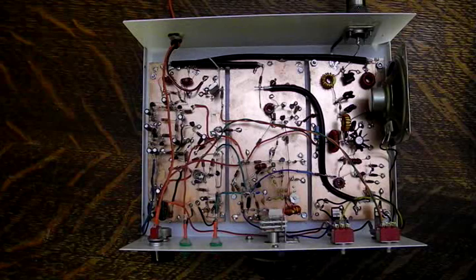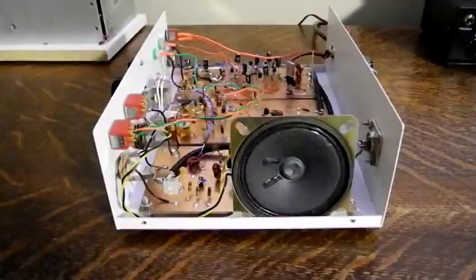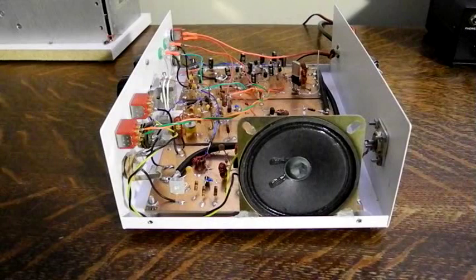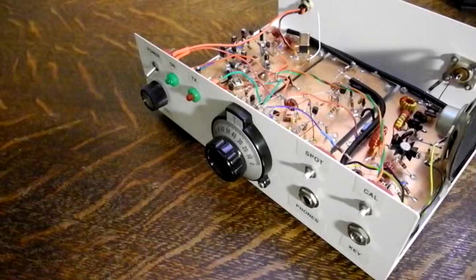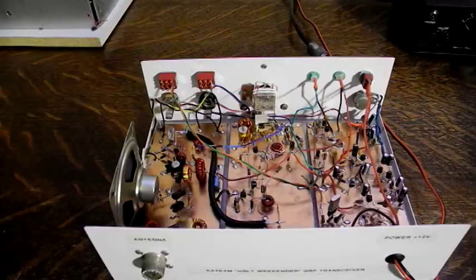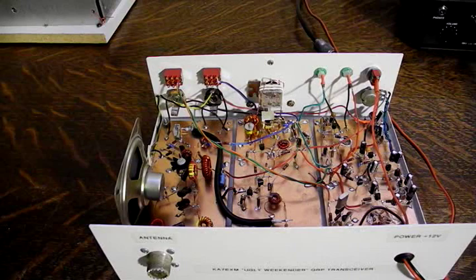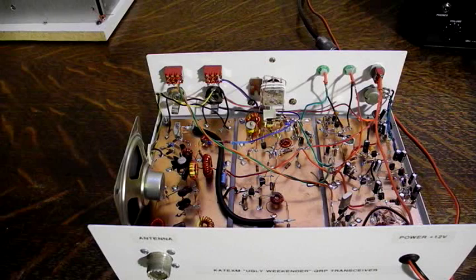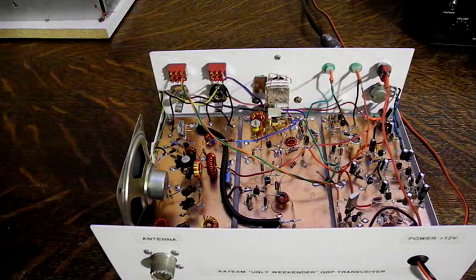Here's a look inside. From left to right we have the receiver board with crystal calibrator and sidetone oscillator, then the VFO and control board, and finally the driver and power amplifier. I followed the design with no significant changes except for a few small component substitutions. I implemented the crystal calibrator using a 7.04 megahertz crystal I had handy. I used an 8-to-1 vernier dial to extend the range of the tuning knob. I get about 3 watts out at full drive level but adjusted it for 1.5 watts as recommended in the article. When adjusted so that the low end of the tuning is 7.0 megahertz, I get an upper frequency range of about 7.120 megahertz, giving me pretty good coverage of the CW portions of the 40 meter band.